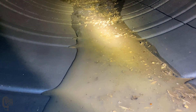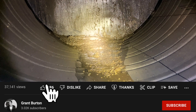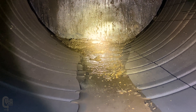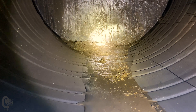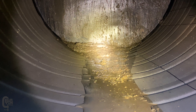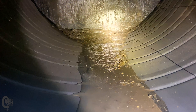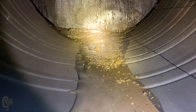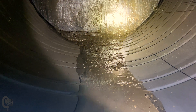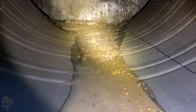If your tank has been sitting and it's not agitated around, and you look down this manhole that we're looking in here now, generally speaking you shine a light down and the water looks crystal clear, and then you can see a little bit of sediment on the bottom. However, looking at it now — when I looked in this tank originally it didn't look like there was much. But now that I see it all bunched up along one edge, there is quite a lot of sediment in here. Probably a mixture of mud and plant material that's been decaying over time, a whole lot of seeds, some leaves.